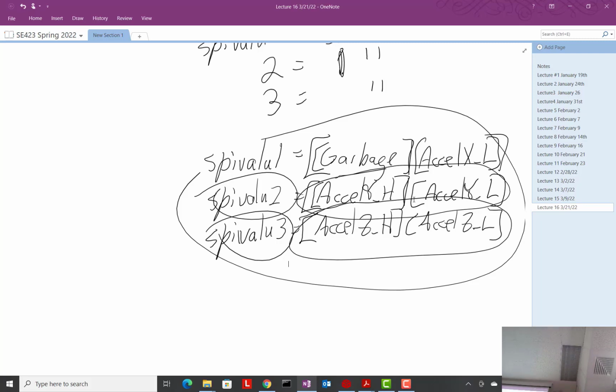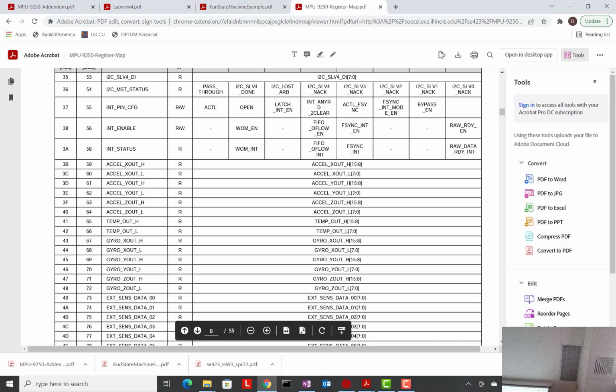Okay, so what do we want to do on exercise 5? We want to read XL X high and low, XL Y high and low, XL Z high and low, temperature out high and low, gyro X high and low, gyro Y high and low, gyro Z high and low. So what register are you going to read first besides U2? We are going to read int status first. And do we care what int status is? Nope. We're going to read it and throw it away. But then the next 16 bits we read, boom, it's going to have the full XL X. And then XL Y. Boom, done. Okay? Good, yeah.